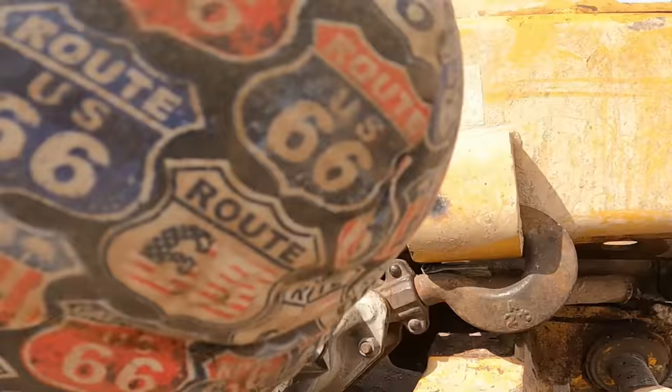Okay, so I got that side done. I ended up welding over an old weld. Should have left it alone. But anyway, it looks alright, and it's at least decently consistent. I ended up grinding the weld under here off because I am gonna put that plate that I talked about just to help strengthen it, because I didn't like the way that was welding when I was doing the overhead. So now I'm gonna do the other side over there and get that finished up.